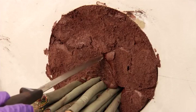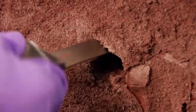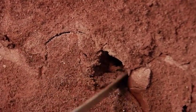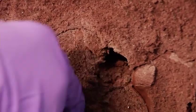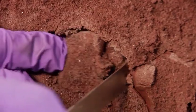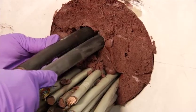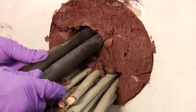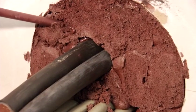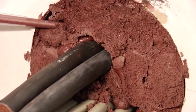Another benefit of the 3M FIP One-Step is that you can re-enter very easily after the foam is cured. If you have additional cables or pipes that need to run through an opening that is already fire-stopped, you can take a serrated knife and cut out a hole the size you need. Once you re-enter with your cables or pipes, take the 3M FIP One-Step and dispense the foam to fill in any gaps from the re-entry.